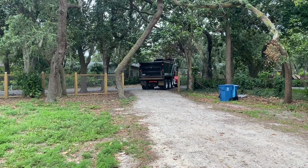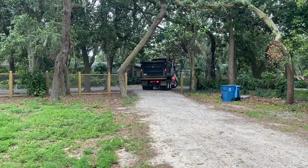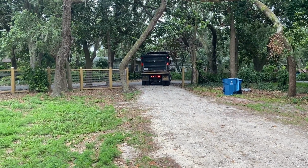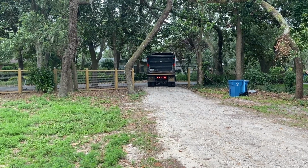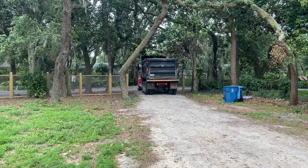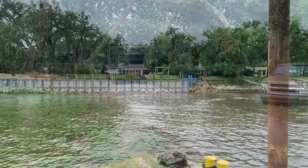It's such a big hole, I'm going to wash some of the dirt down so it doesn't settle, and try to keep it all nice and compact, because if you don't do the washing down after you get a good heavy rain, you'll get some holes in the backyard, and when that happens, the customer thinks the wall's leaking out. Don't want that to happen, and if they've done pavers or landscaping or whatnot, then it messes all that stuff up also.